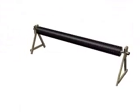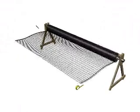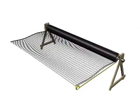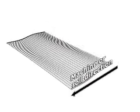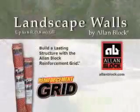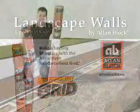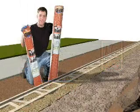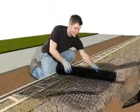Using GeoGrid is the easiest way to add support to a wall. Most GeoGrids typically come in large rolls and in a variety of strengths. These GeoGrid types are strongest along the roll or machine direction and are cut to length — they are best suited for walls over six feet high. AB Reinforcement Grid is designed for walls up to six feet high. It comes in three and four foot rolls and is biaxial, which means it has the same strength in both directions and can be simply rolled out along the wall.